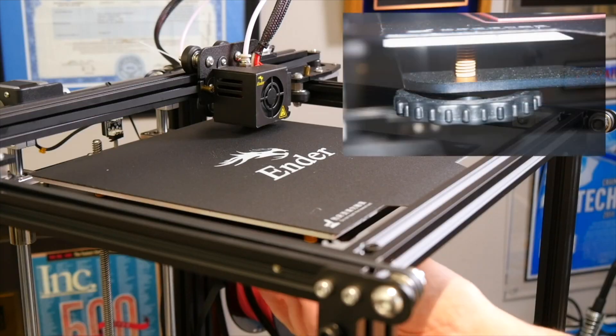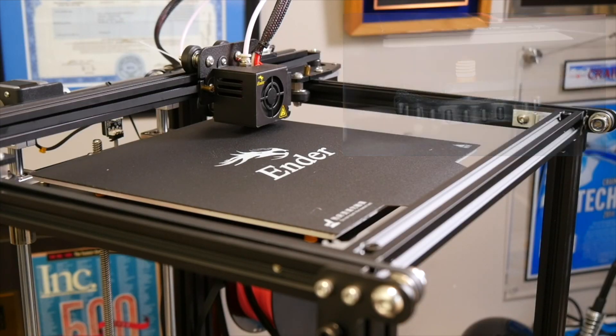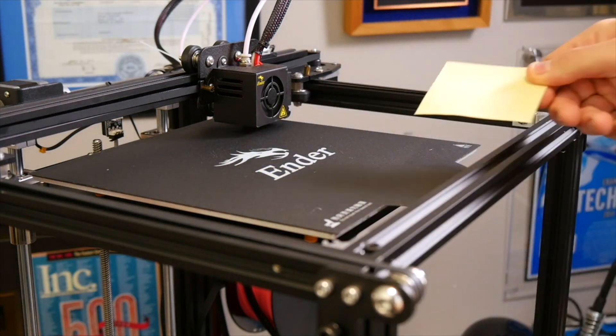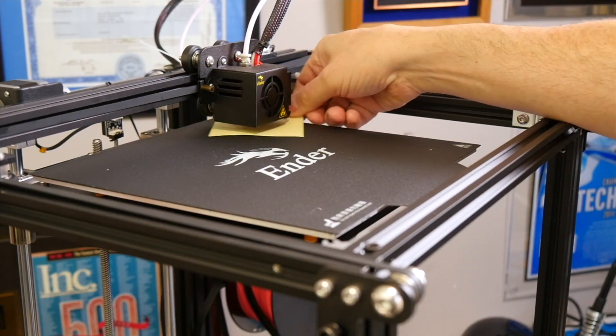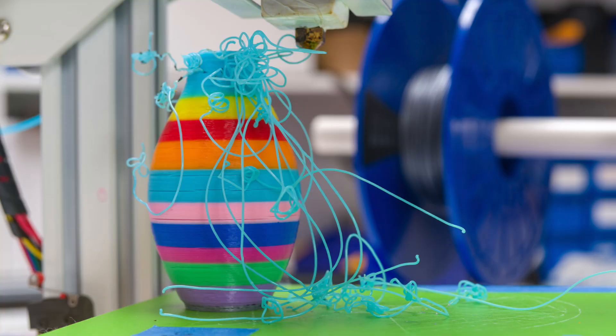You've successfully assembled your printer, or at least taken it out of the box, and you think you're ready for your first print. Stop again. Because even if your printer says it has auto bed leveling, you need to check the bed leveling before you begin. If it's too far off and the auto bed leveling can't adjust — or let's say you're using a Creality Ender 3, which has no auto bed leveling — if that bed isn't right, your first print will not adhere to the bed. It will come off. There is nothing more frustrating than a print that tips over 25% of the way done. So learn how to level your print.